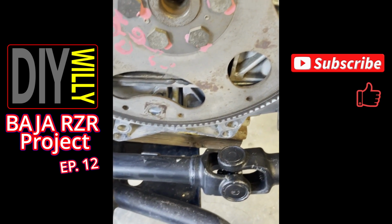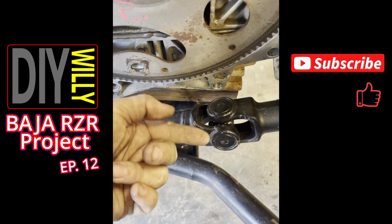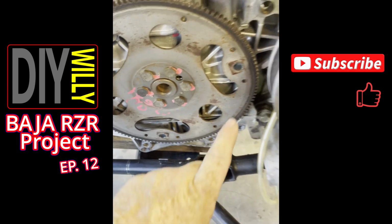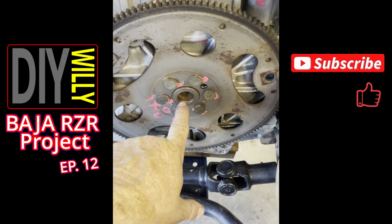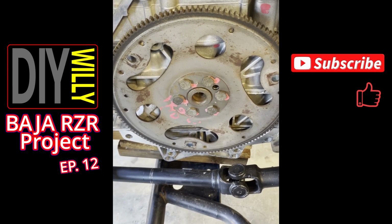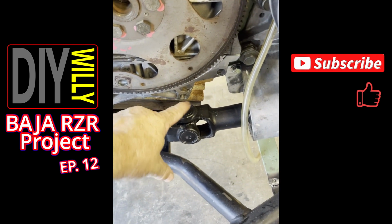As I said, it's not exactly where it needs to be right now because it needs to come up some more. You need to be able to turn the unit, or turn the RZR, for the drive shaft to turn it. Right now it would hit that, so I had to push the engine a little bit too far that way. But the clutches are now going to work, and if you take center to center on here, it's about 11 inches. We need, or excuse me, it's about 10 inches. We need a 10 and a half. So we're still going to go forward a little bit back here and up to make it miss the joint.